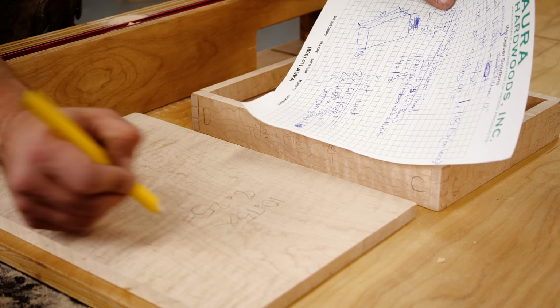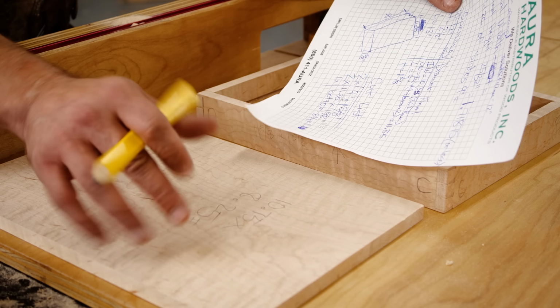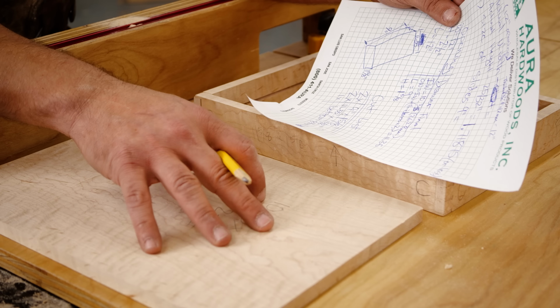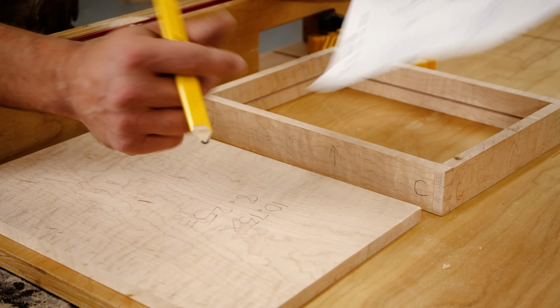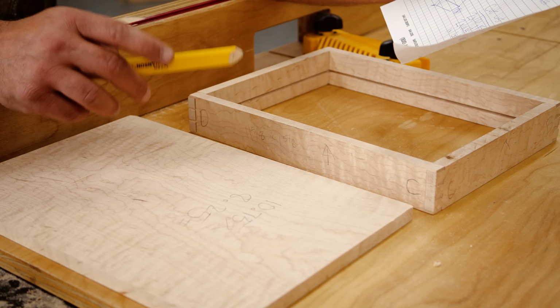and probably go a little heavy on the 8.25. That way it has a little bit of room to move around and expand and contract over time. When you build drawers, you don't glue the bottom in so that it can kind of expand because of the seasonal change in humidity. So I'm gonna go ahead and cut this to the right size and then go ahead